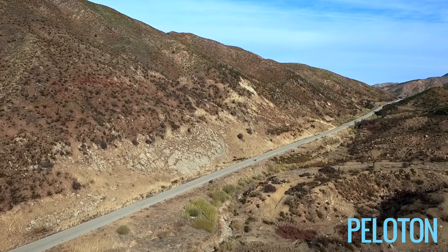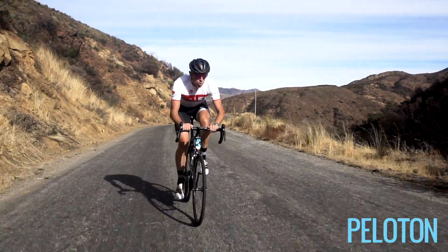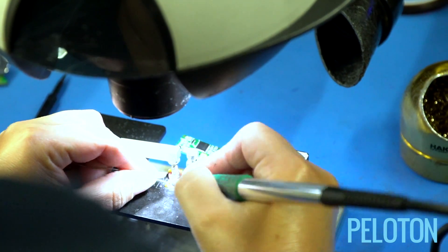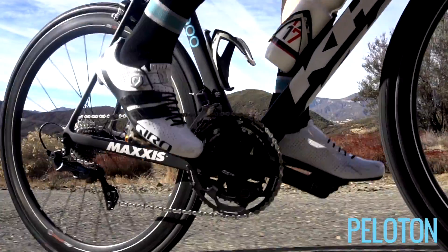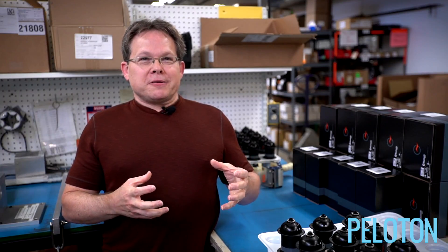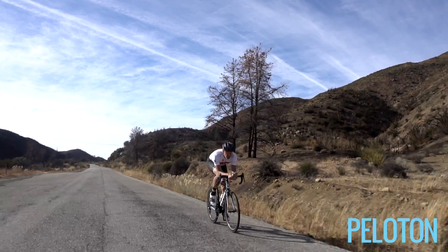Getting things consistent during a ride has always been a challenge — for the P1 especially, because it is such a small package, and the G3 was a huge challenge because it was the first one out there. The small strain gauges that are actually measuring torque and forces change properties, so you need to know the temperature of that material to get accurate readings. They're constantly checking temperature to do temperature offsets. Anytime you have an electronic product, where it goes really matters — it can be totally soaking wet or very cold and that's okay. They make it so you can just set it and forget it and use it.